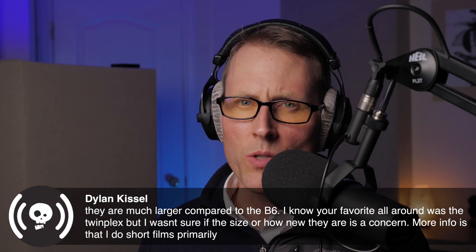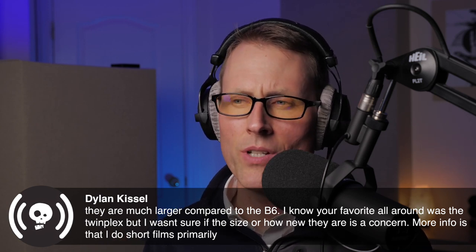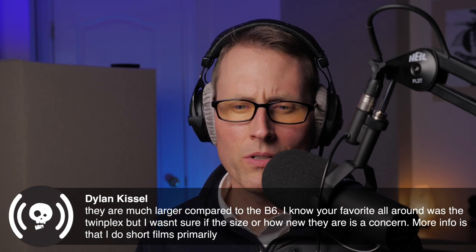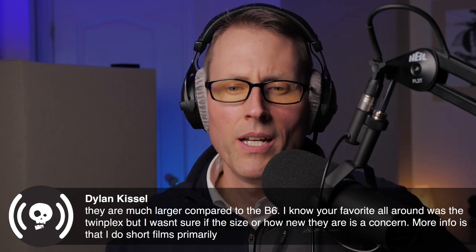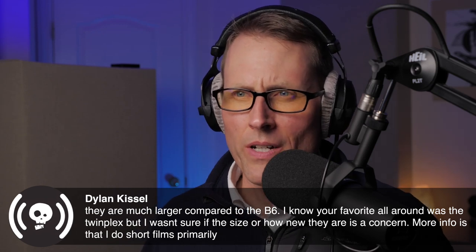The Sanken actually hides pretty well too. Even though it's long, it's pretty skinny, so it's not too hard to hide that, actually. And it's a super durable mic. The only downside with the Sanken, from my point of view, is that that cable's pretty thick. So if you're going to be hiding it on someone that's wearing very form-fitting clothing, that can be a little tricky to hide that cable. So that's a consideration there.